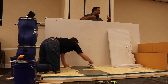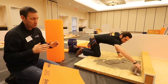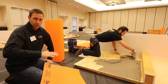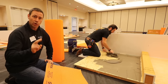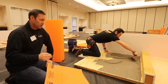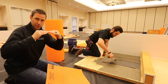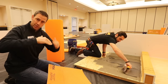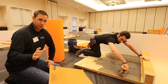In Texas, most houses are built slab-on-grade, meaning there's a concrete slab and the house is built right on top of it. So we've got a lot of bedrooms and bathrooms on the first floor right on concrete, with tile installed directly on that concrete. Now there are two types of concrete in the world: concrete that's cracked, and concrete that's going to crack. You never know where you're going to find a crack in the future, and if you're installing tile right to concrete, when that concrete cracks, that crack migrates up to the tile because tile is a hard and brittle surface.